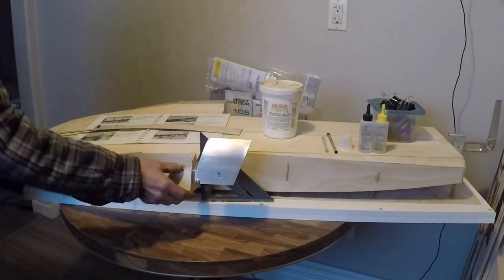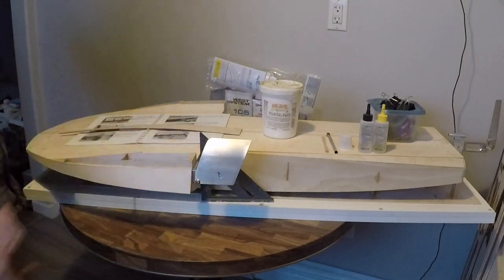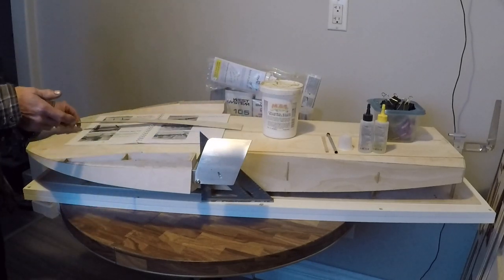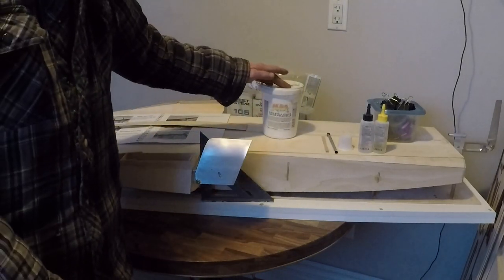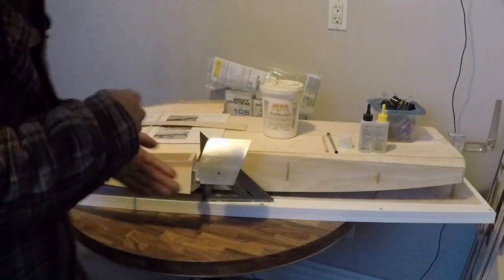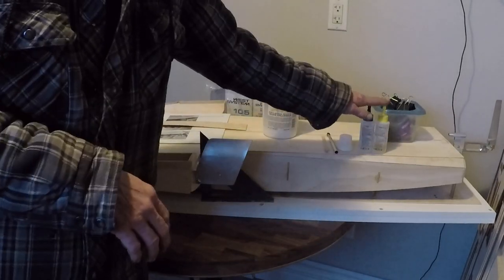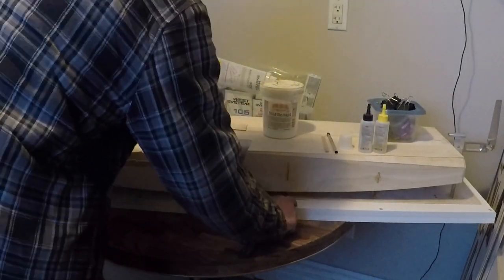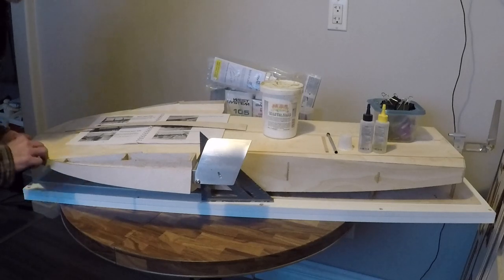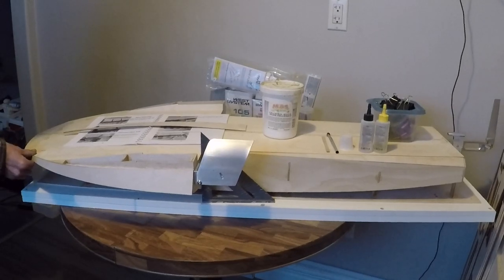Now that I've got you up to speed on what happened with my first forward non-trip, I'm going to spin the boat around and install the left-hand second one. We're going to clamp it the same way, but as I'm mixing my epoxy you're going to notice me adding colloidal silica and getting it to a peanut butter consistency. When this mixes with the epoxy it turns a really nice white color, so it's very easy to see — you can actually see a very nice light white fillet around the edge where it stuck everything together. The forward non-trip is now on there as solid as you want.